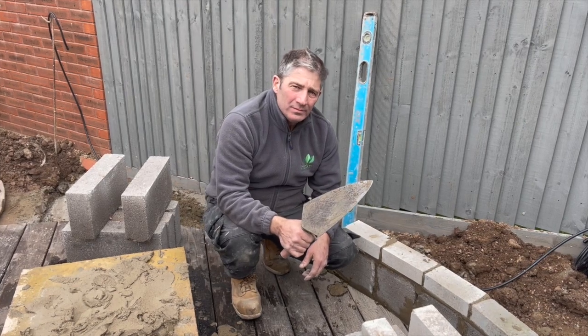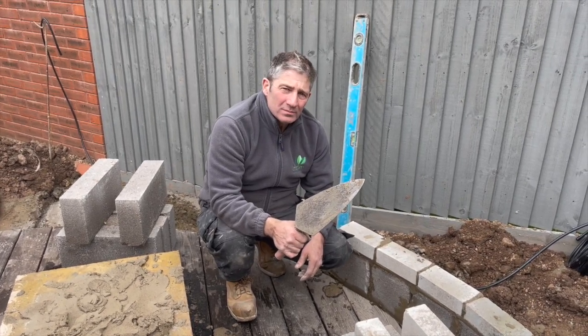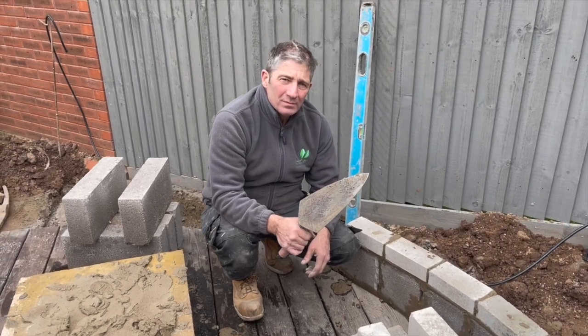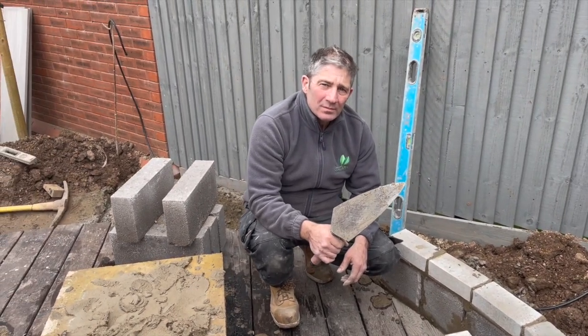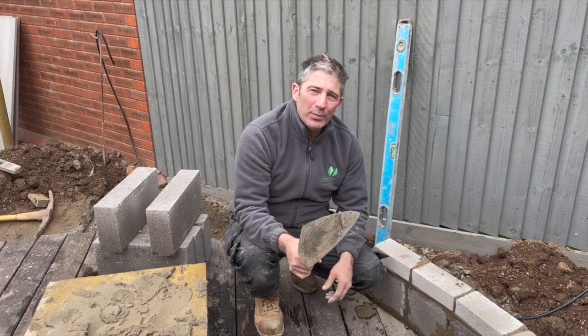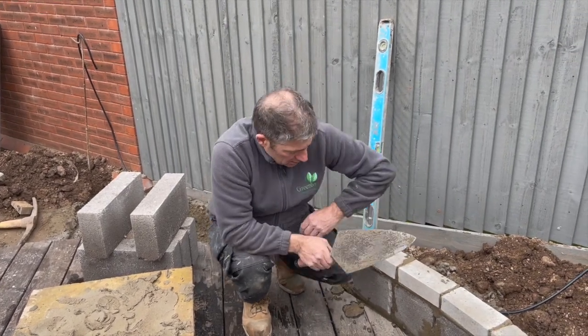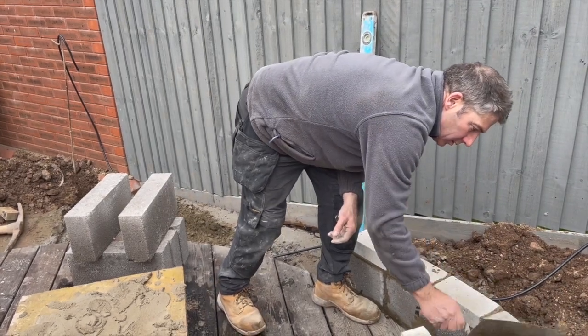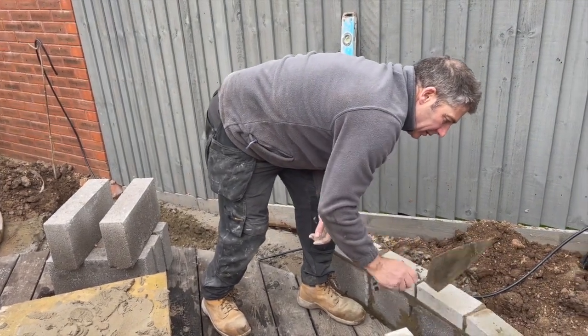I know in previous videos you've done it in one before, but then you've worked with so many different types of porcelain, some's better than others. You can do it, but it's not always the same practice for every porcelain, is it? No, and to be fair, I think it's better. It's less stress on the blade and the machine. Yeah, to do it that way, it's just better all round.